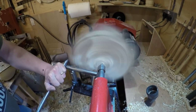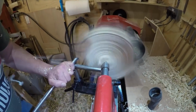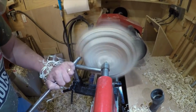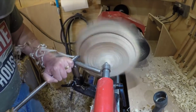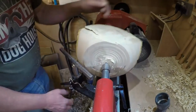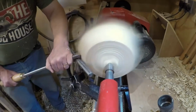This is now the third bowl I'm turning. It's a bit like a production line, as I'm working on all the outsides of the bowls first. The plan is to make 2 rough turn bowls that will be boxed up with their wet wood shavings and 2 live edge bowls. The live edge bowls I'm actually going to take down to a finished state and left to dry naturally, then later come back to those, sand them and then just remove the tenon.